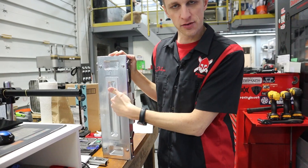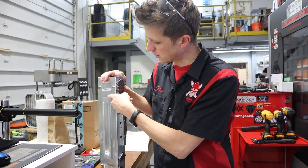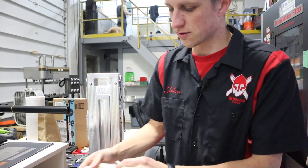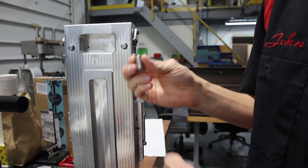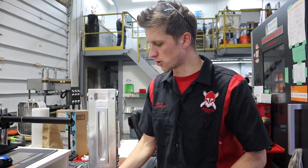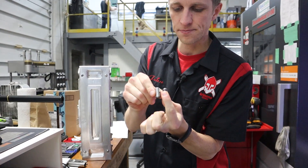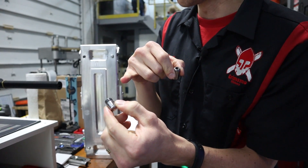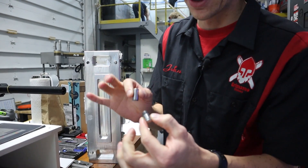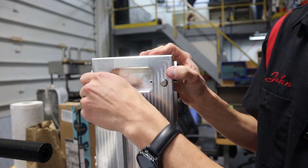I made this palette; Amish made the four new ones we're going to be using. I based it on the orange palette layout with a 45-degree dovetail and four locating pins. The orange vices come standard with half-inch dowel pins threaded on one side so if they get stuck you can screw in a bolt and pull it out. The problem is they either stick in the palette or stick in the vices — two will stick and the others come out, and they're super annoying. So I created these: basically the same thing, except threaded on one side with half-inch diameter by metric 1.5mm thread. It works pretty awesome — these guys thread into the fixture, locate well, nice and tight.